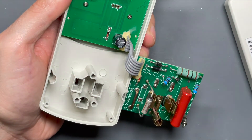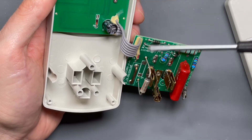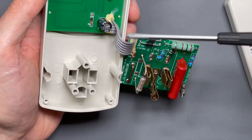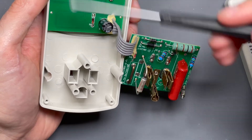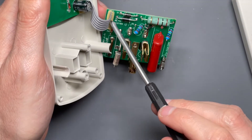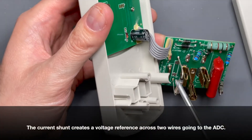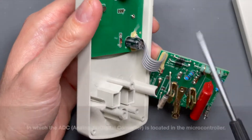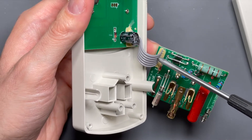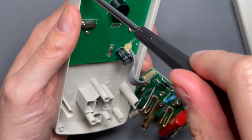I think what's going on here is we've got power coming off this board to power the circuitry — there are six wires. Two are for the power supply, and the remaining four are for the derived voltage reference and current reference, to provide the brains of this device with an appropriately scaled voltage and current waveform. These diodes go off to two pins on here. It's scaled down to a lower voltage that the microcontroller can work with on its analog-to-digital converters for current and voltage measurement. They both reference back to ground, so: current, ground, voltage, ground — though I'm guessing on the order since I'm not going to reverse engineer the whole board.